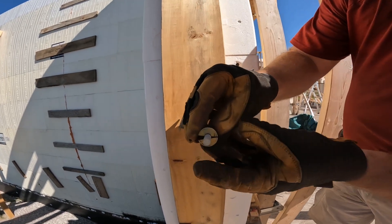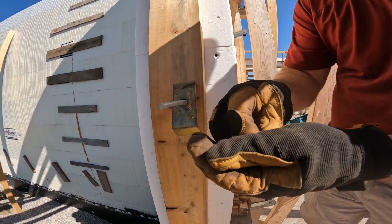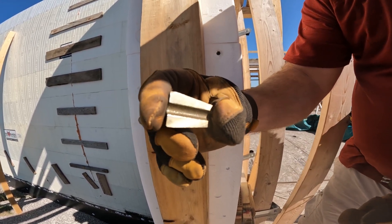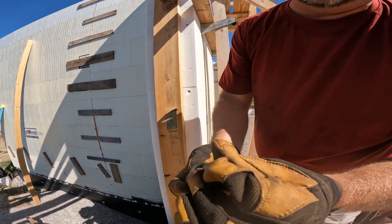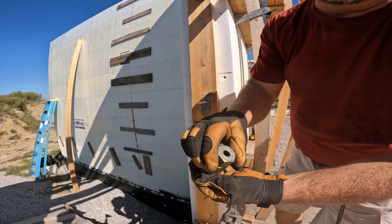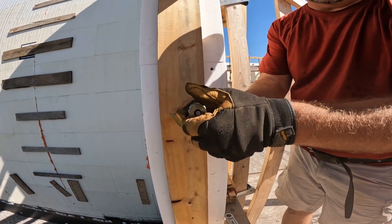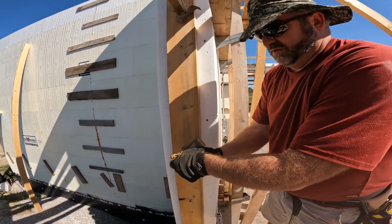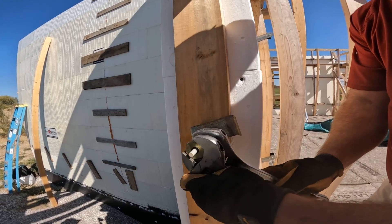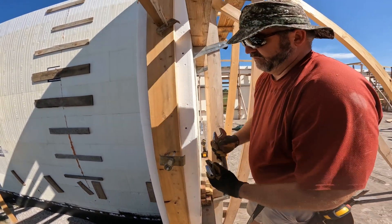Can't work with the gloves on. Clamp right on those and the ridges in there — the ridges inside there grip onto the pencil rod. So you load them in there like that, and that guy goes in and they should slide on easy. And since we can take the slack out on the other side, I just need the rod to the back here, and I go ahead and tighten this part up, and that sets those wedges down into the pencil rod. Quarter inch pencil rod — then we're going to have two by fours on either side of those and they're cutting them right now.